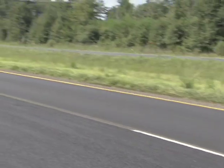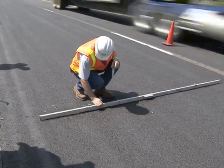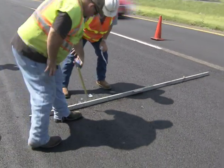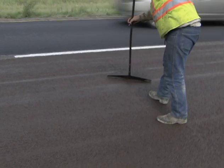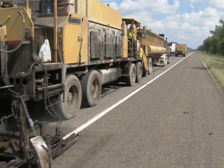Micro-surfacing needs to be used where it's designed to be used — on a road with a good pavement structure. Unless the road's been rebuilt or I'm real familiar with the pavement structure, we usually run the falling weight deflectometer on that road to see if we have any soft spots. Our pavement engineer likes it to deflect less than 30 mils in any particular spot on that roadway before he's comfortable with it, and I agree with that.